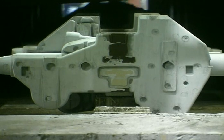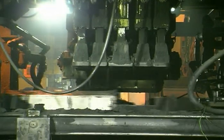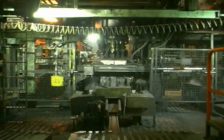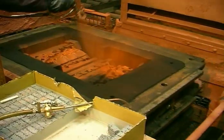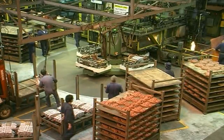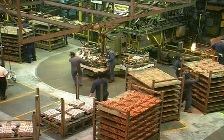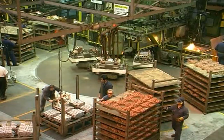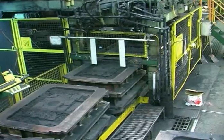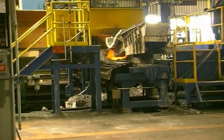These parts are keyed together using a cold setting sand. At the same time as the cores are being made, green sand drags are being produced by a fully automated jolt and squeeze method of production. The drag is sprayed with a mould dressing. The cores are assembled and placed in the drag by a team of seven people working in unison. The cope is closed with the drag. The launder, which is a type of trough, tops up the pouring furnace that moves along with each mould, filling them with molten cast iron.